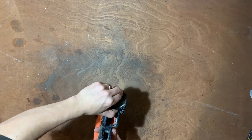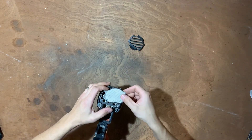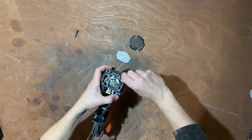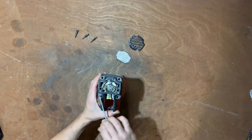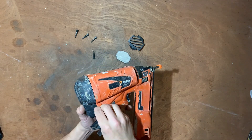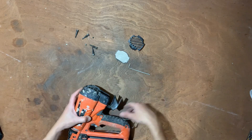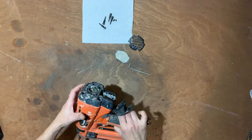Take out any brads or pins that you have left inside the gun. And then take off this filter at the back — push it in here, it should pop off. That needs a clean. Then we take off these four bolts on here. Put your bolts on some kitchen roll so they don't get mixed up and get lost.